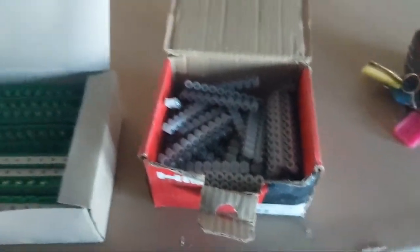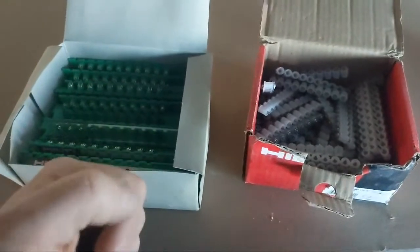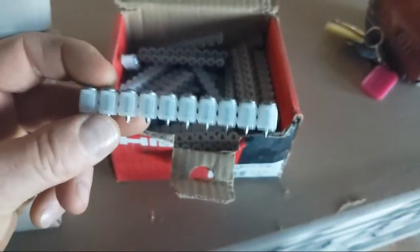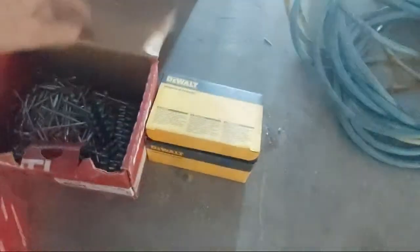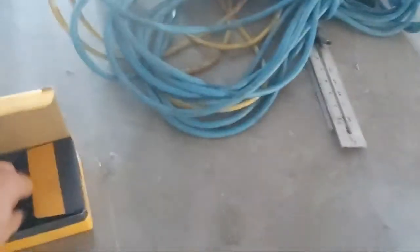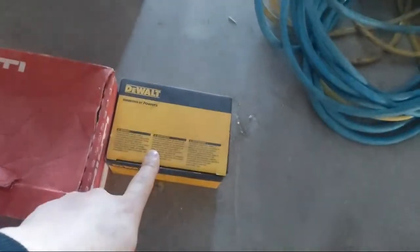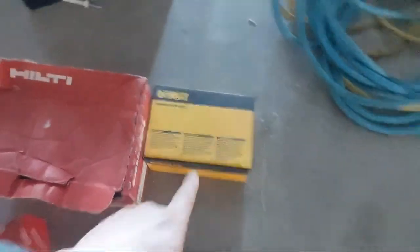Right on. So these here are the Hilti pins. I use the green tabs basically for everything. The green's the best. The nice thing about the 351 is I can turn the strength up and down, okay? These clear ones are for shooting onto steel, so that's steel to steel. And then the black ones here are steel to concrete. And then we can also hammer drill and pin track down to the concrete with these pins, okay? These, people call them smack pins or pin bolts. But whenever you're doing something onto CMU, they're the best.